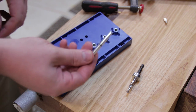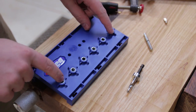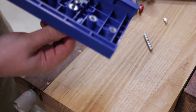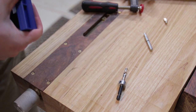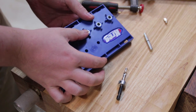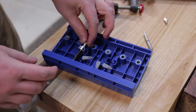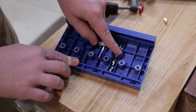Taking a closer look at the jig: we've got the indexing pin which goes in there - it's got five mil on one end, quarter inch everywhere else. These guide bushings are for quarter inch bits, but this has a step on it so it will fit into these steel bushings with very little slop and still drill the five mil hole. On the back side we can see the fence - this can be unclipped and put on the other side, which just affects the distance the shelf pin holes are from the edge of the cabinet. Also on the back we've got storage for the drill bit and for the indexing pin, and that's also how you set the position of the stop collar.